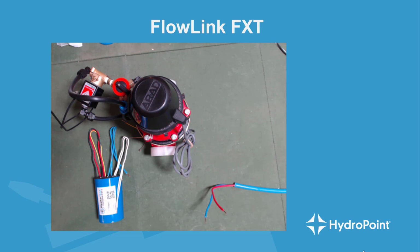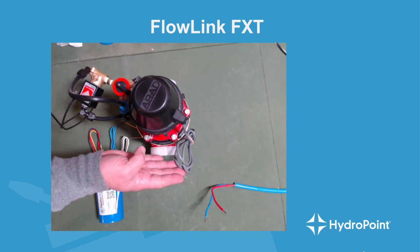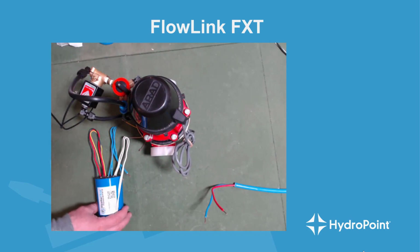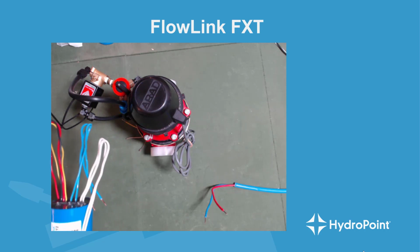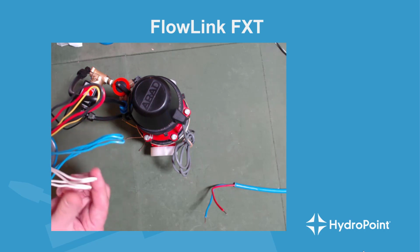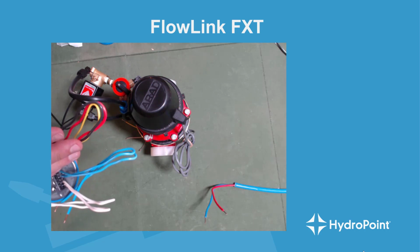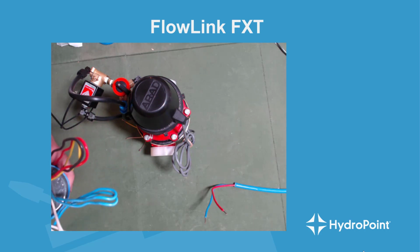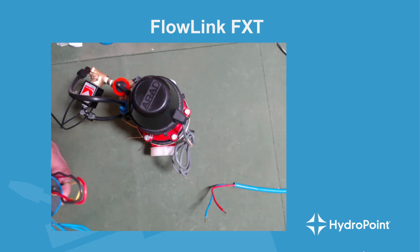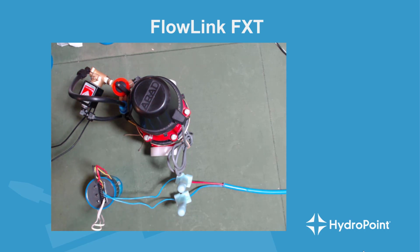Alright, we call this the Flow3 because it's got three flow devices in one: the meter, the master valve, and the flow sensor. And again, we've got our FlowLink FXT that has three different sets of wires. The blue will be the power wires, the white will be the solenoid for the master valve, and the black, red, and yellow will be the flow sensor wires. So just like in the last example, our first step is to wire our two blue wires to the incoming power supply, making sure we use our DBY gel caps.